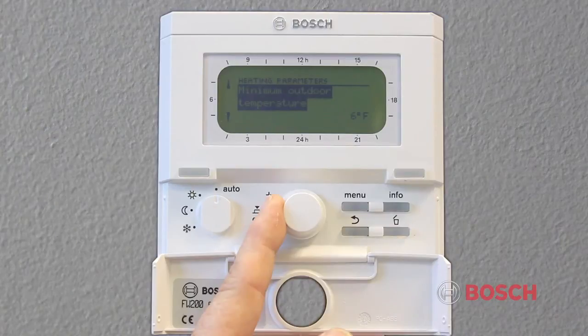These numbers should be available from your local supply house or on the ASHRAE website under Degree Day Data. There are many other sources of this information as well. Building storage capacity is how well the building you are heating holds energy. By default, building storage capacity is set at 50%. Of course, you can increase or decrease this number depending on how energy efficient the building is.